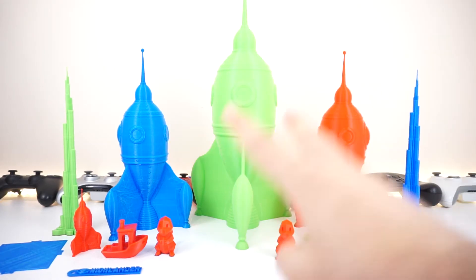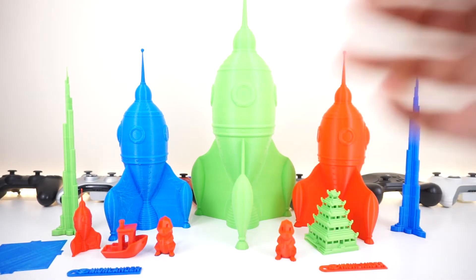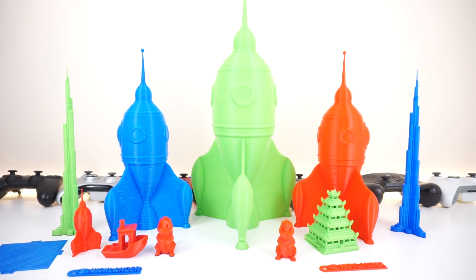I've also encountered two more issues on top of my last video, which was the assembly issues and fixes video for the E-10. One of them was actually very easy to fix — that was with the Z-axis motors. They were actually squeaking when they go up and down in certain areas, and all I did to fix it was simply put in some sewing machine oil.